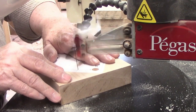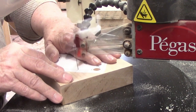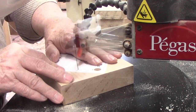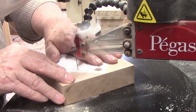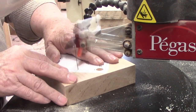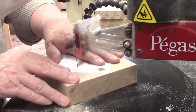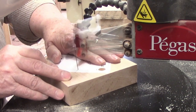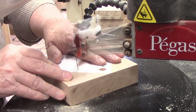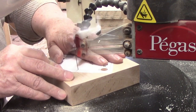While I'm making the long, slow cut for the heart shape, I can explain the change I decided to make in the plans. As I already mentioned, the plans called for 3 pieces of 1/4 inch dowel rod to be used to hold the top in place. But I had one of those light bulb moments when an alternative method came to mind. I have plenty of ceramic magnets on hand that I use mostly for the personalized name trains to couple the engine to the cars and caboose. Why not use these instead of dowel rods?